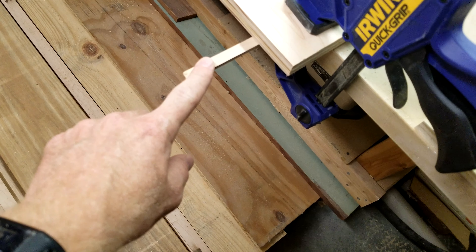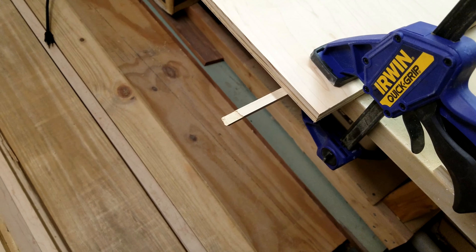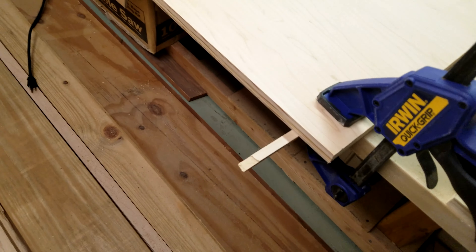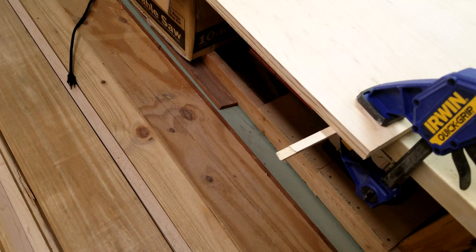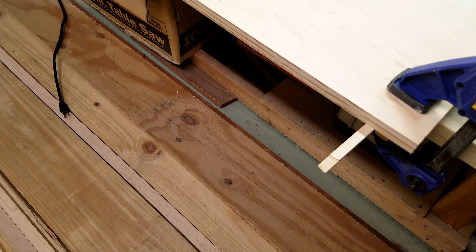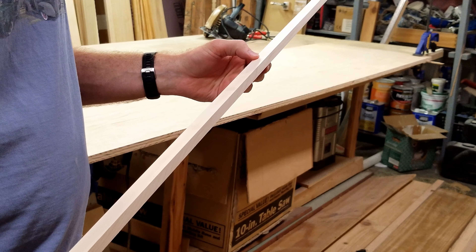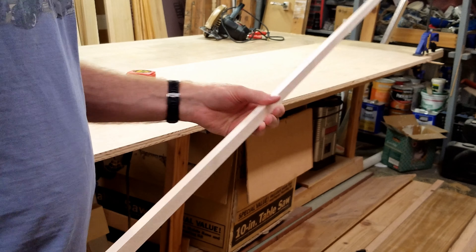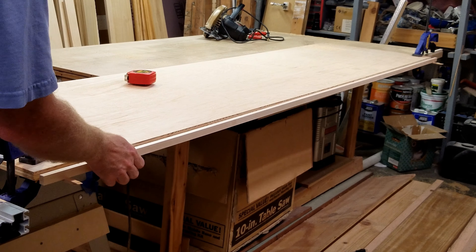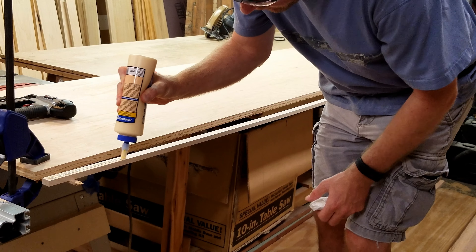To help me set up and so I don't have to hold the edge banding, I've put little stickers sticking out from the edge — they flex up and down so I can work it up and down and just set my edge banding here. I'm going to run a bead of glue along this edge, make sure it's all smoothed out, and then I'll press the edge board along there and take some pin nails to pin-nail it in, along with some clamps to help clamp it on. I need to check which side is the best side so I can have the best face out. I'll run a bead of glue along here on the surface.